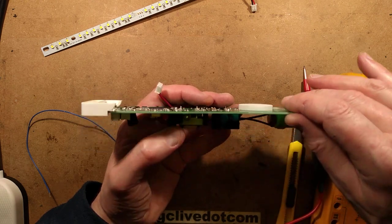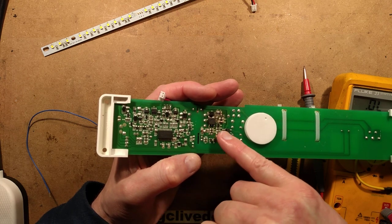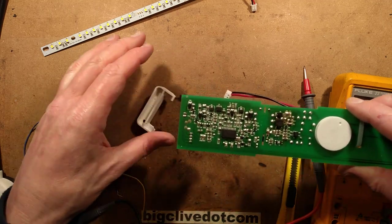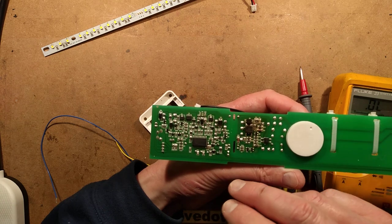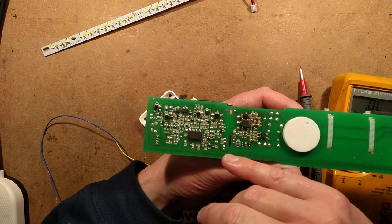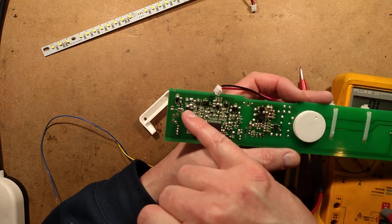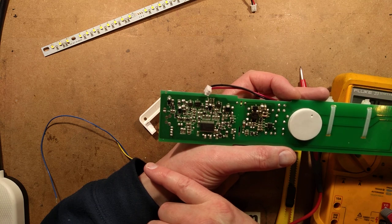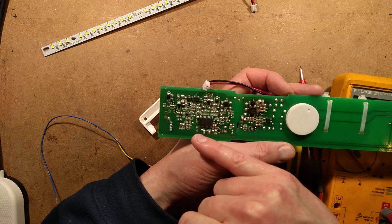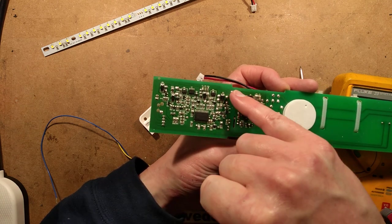From this little capacitor and this diode, it's most likely the bit that powers the chip itself — fairly textbook. The other side I'm not going to try reverse engineering — this is a microcontroller with lots of circuitry. There's an inductor, which gives the clue: it's got a boost circuit to actually drive the LEDs. This is absolutely stuffed full of circuitry. It has the microcontroller and lots of extra circuitry to drive and monitor the LEDs, with anti-tracking slots here.